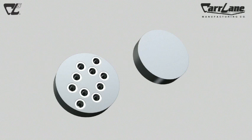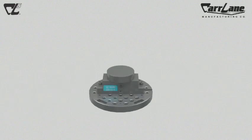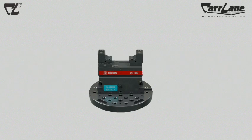Fixture plates are the most basic type of top tooling available in CL5. Like the CL5 subplates, each plate is made from mild steel and precision ground for flatness and parallel. Each also has integrated mounting for the Quintus. By simply adding a Quintus clamping pin, these fixture plates quickly and easily interchange with other top tooling.